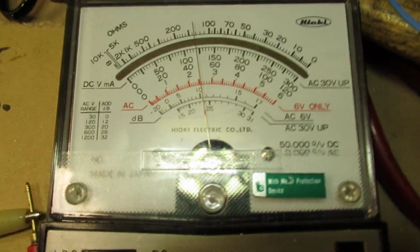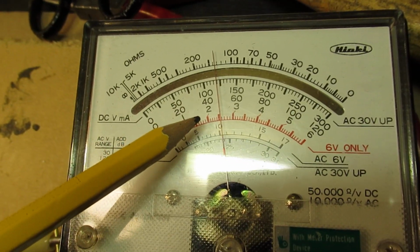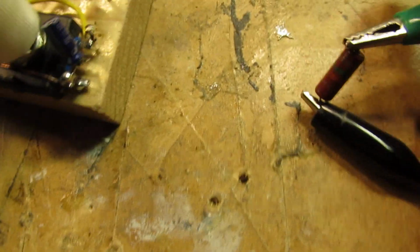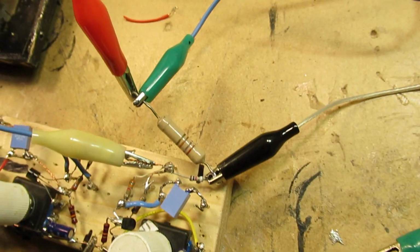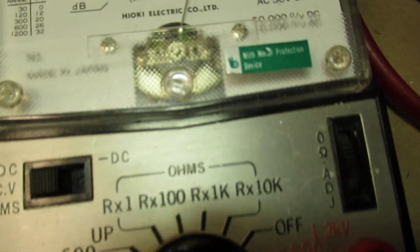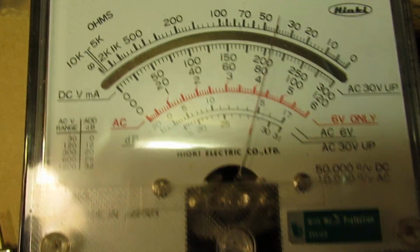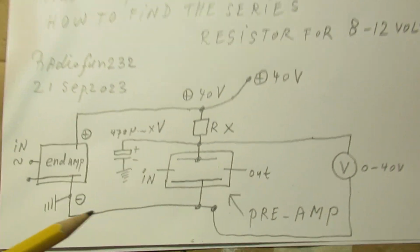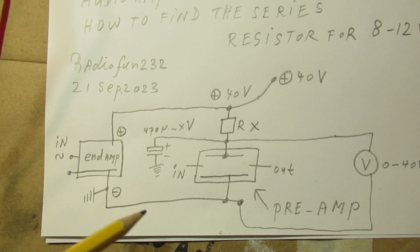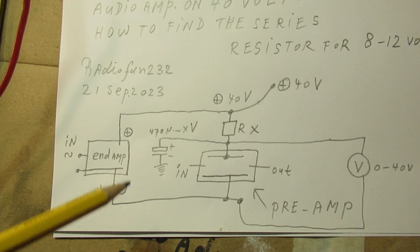Let's see. I take it now apart. You can see here now that the voltage with that 27,000 ohm resistor is approximately 5 volts. So I bridged it with a resistor of 15,000 ohms here. I do that now, so now we have the combination of these two resistors, and now we are on approximately 8 volts. That's important. And furthermore, you can do that experimentally. And when you have here capacitors that can handle higher voltages, there's no risk that you damage electrolytics or whatever.